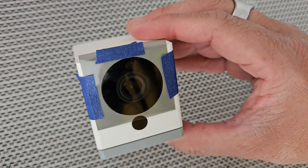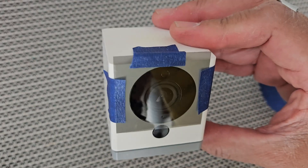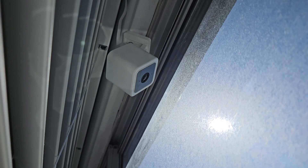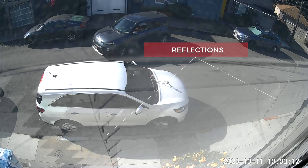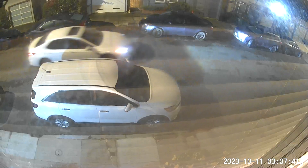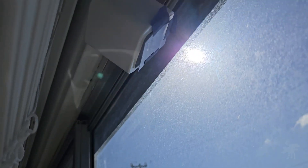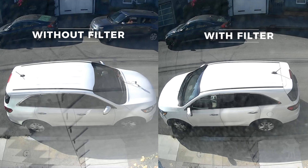Of course, you can be a lot neater or use a different color tape as needed, but that's essentially it. You'll set this up and you'll have far less glare in your footage. Here we have a camera mounted to the top of a window frame inside a house. From this position, the camera has a broad view of the street, but we can see reflections of the window blinds in the footage. At night, the reflection of the window blinds is even more evident due to backlighting from inside the house as well as lighting from the street lamps. After installing the polarizing film, the window blind reflections are still present but greatly reduced. You can see the differences more clearly in the side-by-side — on the left, the camera without a filter; on the right, with the filter attached.